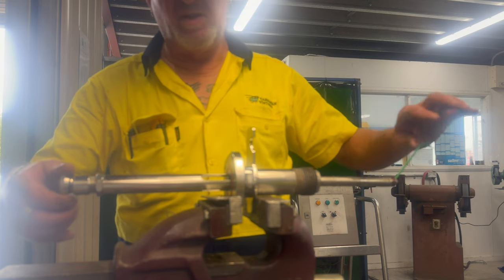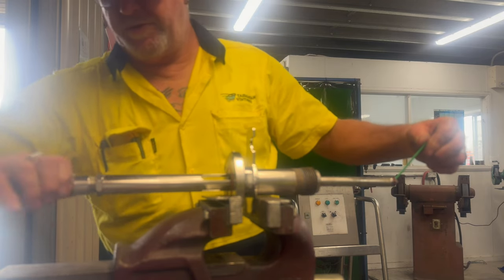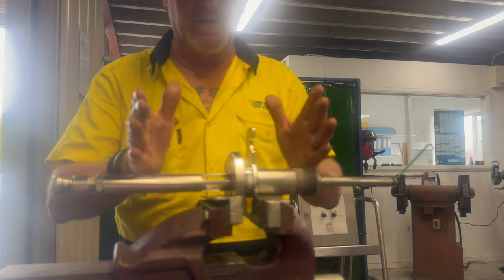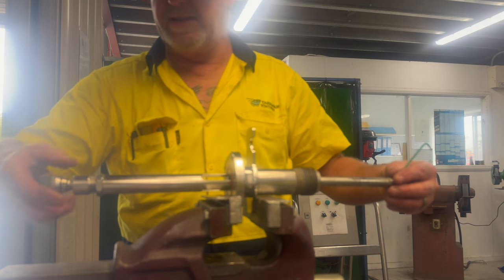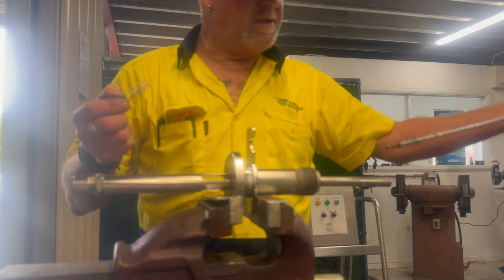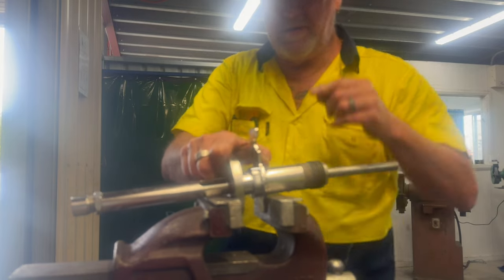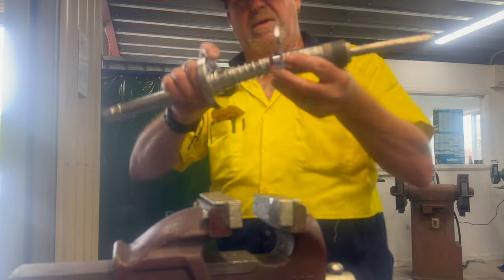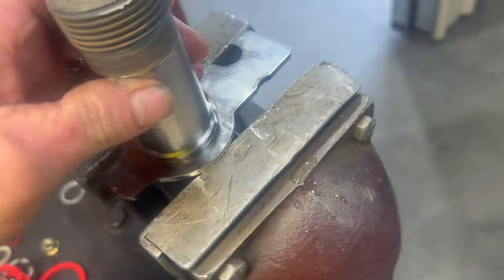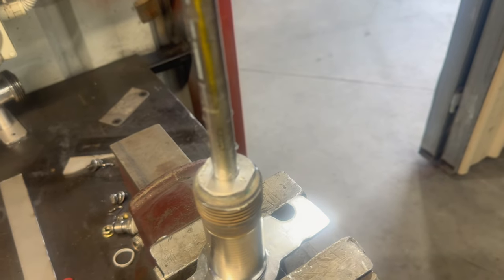So I just put a little Torx bit into the hole inside the gas port and grab the knurled nut on the end and unscrew it. Because we've clamped it together and relaxed the assembly, it's not under spring tension. There is a small spring in the back. Then we just extract that valve and we can let this thing go. And there's our spring and some seals.